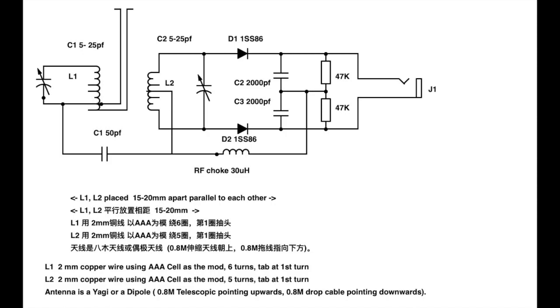This time I tried to revert back to the beginning and started a circuit using the conventional Foster-Seeley detector, which is the original FM frequency detector. I've put in my values for this circuit. I chose the diode that I use for FM detection, which is 1SS-86 or 1SS-106.